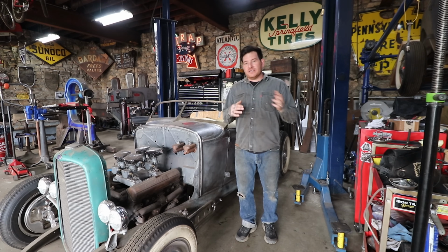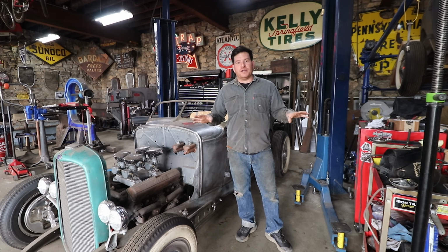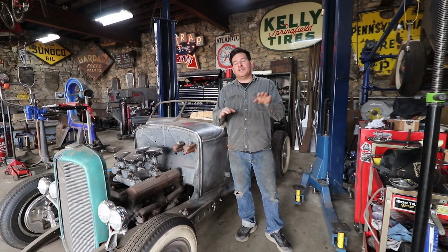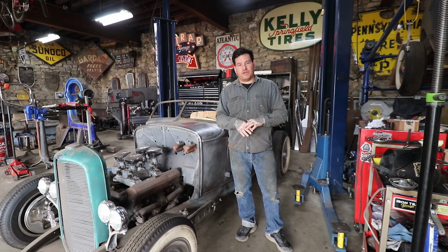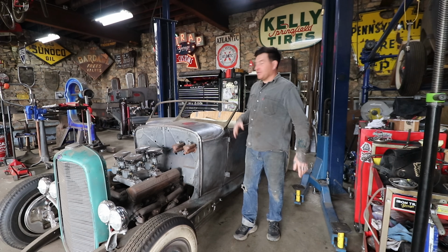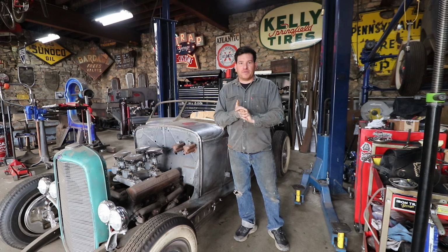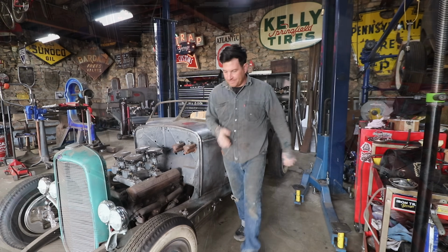What I'm going to do is take that skin, blow some primer in between again to make sure everything is sealed up in there, and then start welding along the seam. I might use some silicone bronze or something to blend it all in, and hopefully we will have a skin that is welded to the inner structure, rolls in nicely, and doesn't flop around, and some of the last clecos in the car will come off, which will be very exciting. So I'm going to get the welder out and get started.